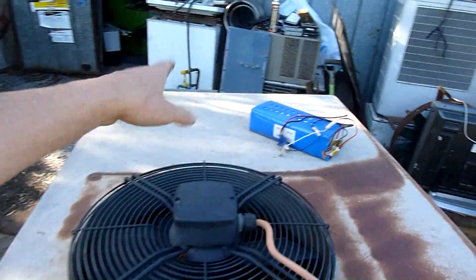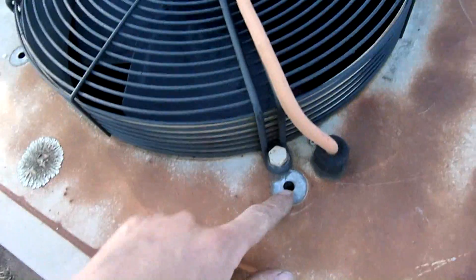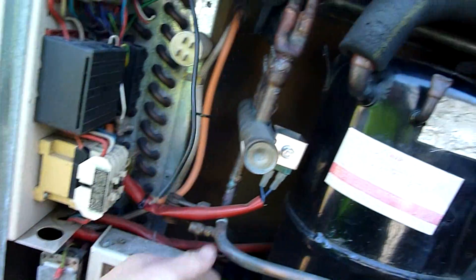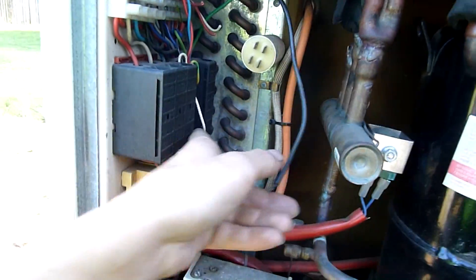It's all R22, it's all heat pumps, so the appropriate indoor unit would be the same as that. But this is a package unit so there's an evaporator box and everything in there as well. The fan's been replaced at one stage, and I'll just strip out all the three-phase controls and go for single phase stuff again - 240 volts. It's got a neutral line, 240 volt fan with its own cap built in.